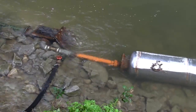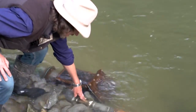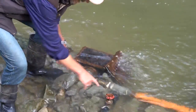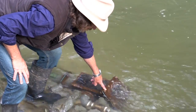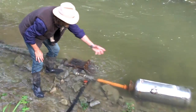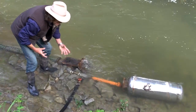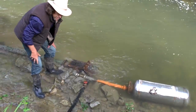So it's 70 psi in strength — probably 20, maybe 30 meters in lift. It just runs continuously on the fall of water. A one-way valve just here opens, the tap opens to the delivery pipe. And this is the pressure pipe with the flapper valve. At this end we have the pressure cylinder, and it's simply got a car inner tube in there at 70 psi pressure. It gives us the back flush of pressure.